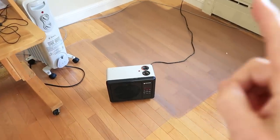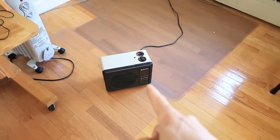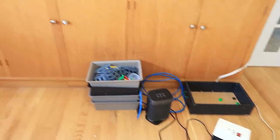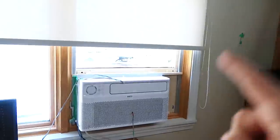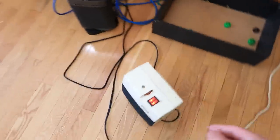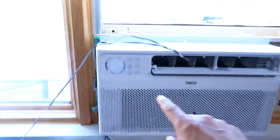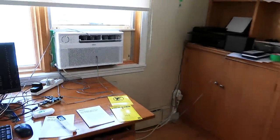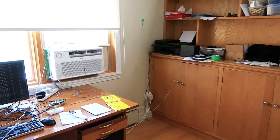This has been running for an hour now. During that time the heater only came on a few times briefly, which is to say that this heater at 1440 watts put out nearly as much heat as the AC would remove. I'm going to turn off the heater and the AC, just to make sure we're still at the same temperature and that this is the equilibrium temperature.